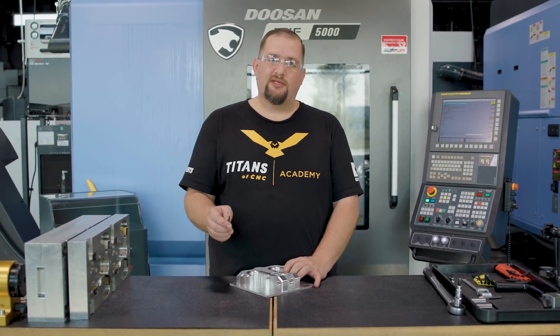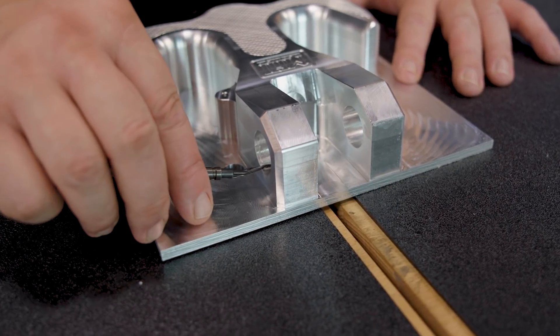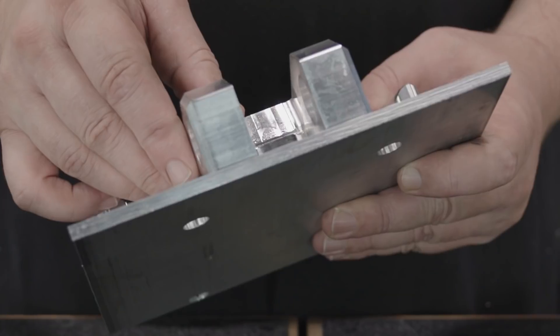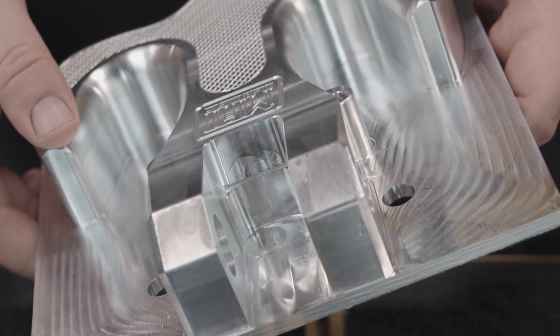If a person is doing this by hand, you're likely to get scratches on the face of the part. If you slip, you're likely to get a choppy finish, and that's undesirable for the quality of a machine part. What we want is a part that's completely deburred where every edge isn't sharp anymore.